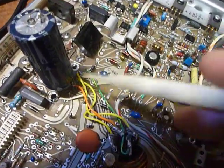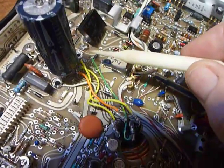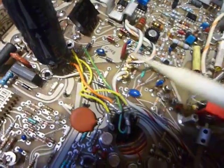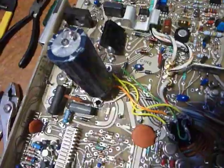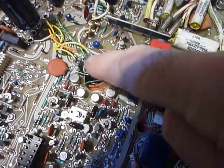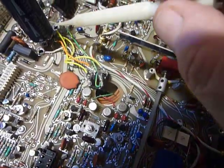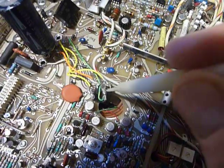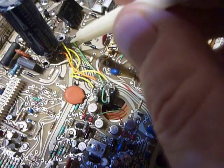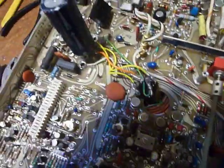This is a temporary capacitor I put on top of the board just for testing purposes — I'm going to take that out and put the regular capacitor back. What I found was that this bridge rectifier assembly — which no longer exists, I crushed it out of there with my large wire cutting pliers — I connected a replacement bridge rectifier right here. It's a different package, higher capacity: the original was 1.5A, this replacement is a 6-amp bridge rectifier. I glued it down with E6000 glue and ran Teflon wires over and soldered them to the little stubs of the original wires.